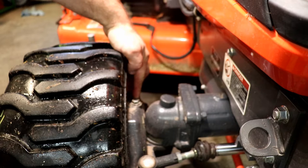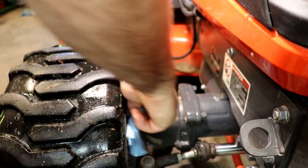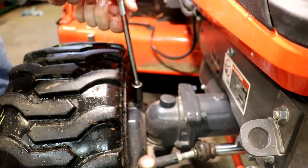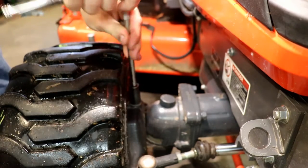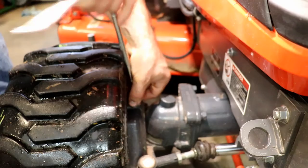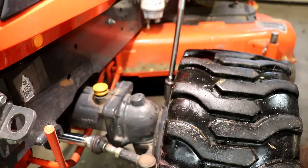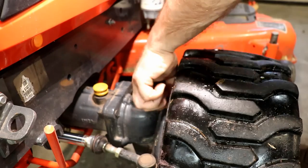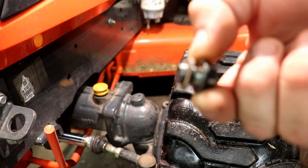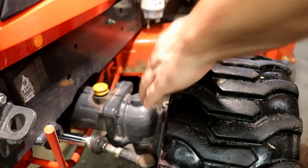If you look on both sides of the tractor on your steering knuckle, there are these bolts. These are to allow air out. I'm going to wipe this off since there's some dirt there and remove it — you'll need a 14-millimeter socket. I'll do the same on the left side. Be careful when you remove these bolts: there is a sealing washer, so do not lose that washer or you will have a leak. And if your tractor sits out in the rain or you wash it, that could allow water to get down into your front axle.